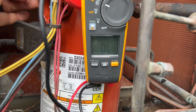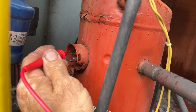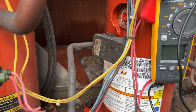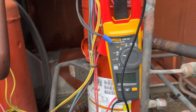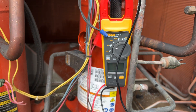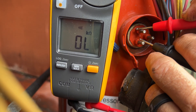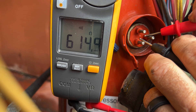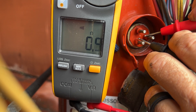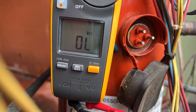I've got my lead hooked up to the panel. Nothing, nothing, nothing, nothing on this one. Nothing, nothing, nothing on the other. We definitely have ground, so I know that's going to be good. We'll ohm out the compressor windings to make sure. It's three phase so they should be fairly equal — 0.9, 0.9, 0.9, 0.9, 0.9. And nothing to ground. That one's good.